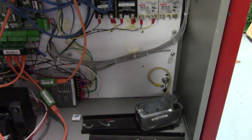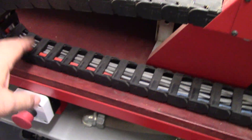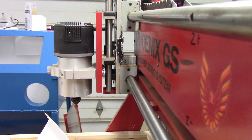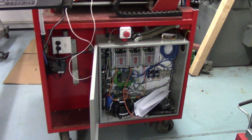I've got to pull all these cables out of the cable carriers and re-thread new cables in there. There are switches on each end of the axis but I'm only going to go with home switches and use soft limits — they work really well in Centroid CNC12. Anyway, I just want to say I'm alive, I am doing stuff — my shop has customers' machines waiting to be refitted. I've just got a lot going on. That's it for now; talk to you guys soon.